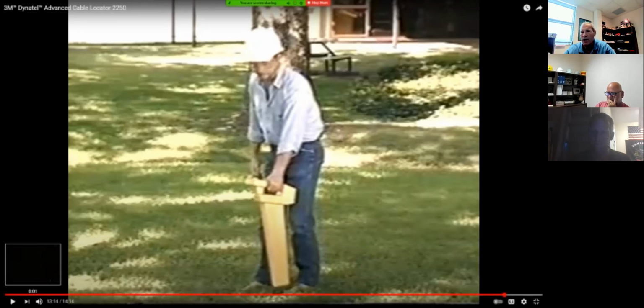So you can actually go down to the point where it's either broken at with a fault finder, or if there's nothing in the pipe, take a piece of wire off your truck, push it down the pipe until it stops, then locate it out until the signal stops. That's a bad part in your pipe. Yeah, 37 years, never used a duct probe. Good.